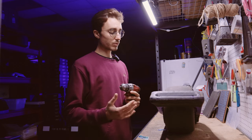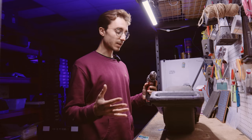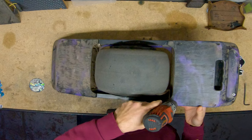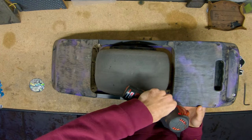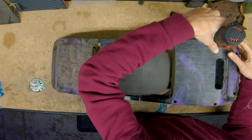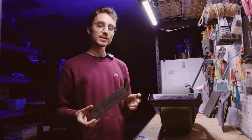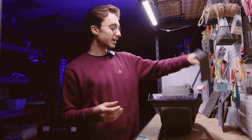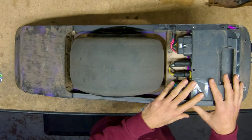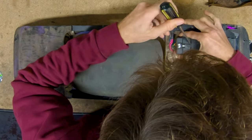The second step is to remove your front bumper and controller box cover. Please do not skip this step — you'll see why later. Now that you have the controller box cover off, set that and the front bumper aside, and remove the connector from the controller box that connects to your battery. You can get a little flat head in there.